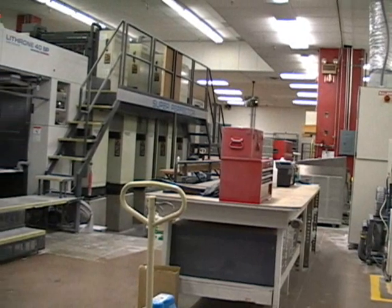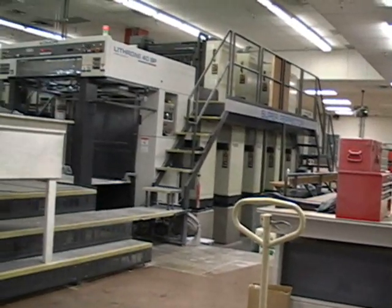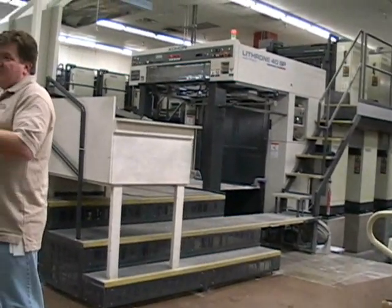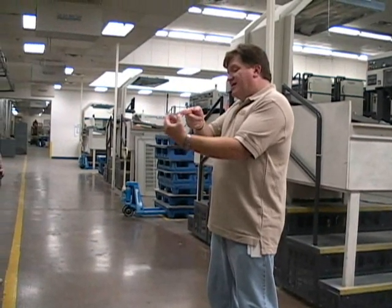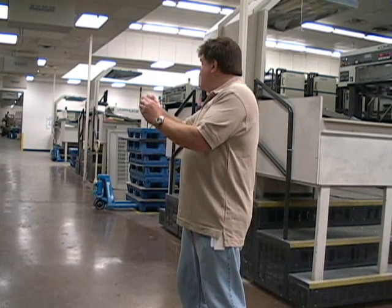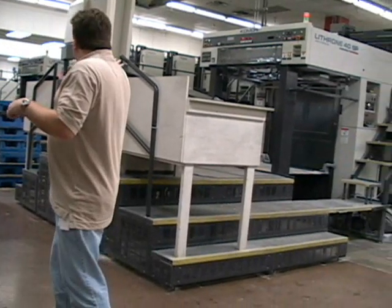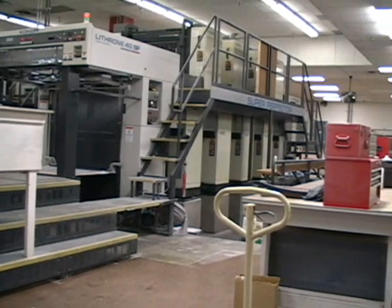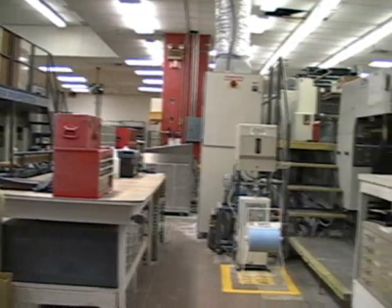Also, if you're using a color background, in the old days, five years ago, when you looked at one of our Taylor X colors, say you wanted a green background on all the pages, you could hold the book up on the end and you'd see this green, this one's a little lighter green, that one's darker. You can see jumps in color in the signatures because they were printing them at different times. These machines, you type in the job number, and it remembers how much ink it dropped on the signature before. So all the green is going to be the same all the way through on the background. Okay,